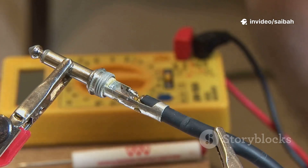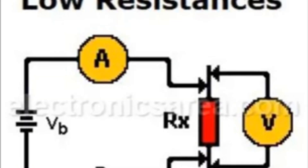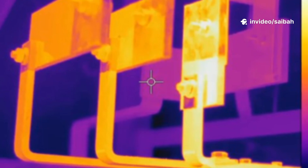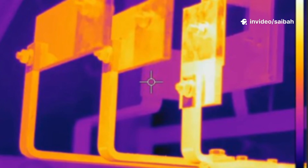Criteria time. There isn't one universal minimum resistance code — limits vary by equipment, material, and manufacturer's spec. I compare today's reading to the nameplate and past records, and add thermal imaging to spot hot joints on bus bars.